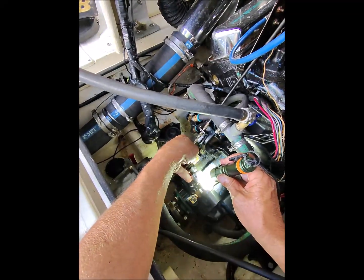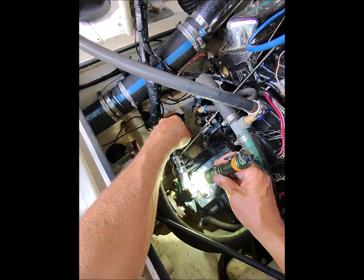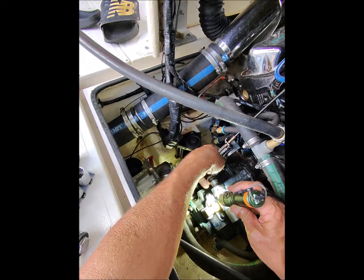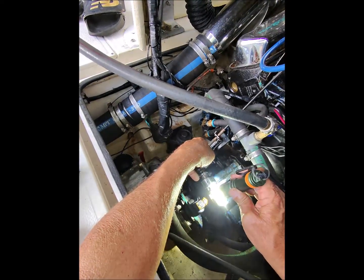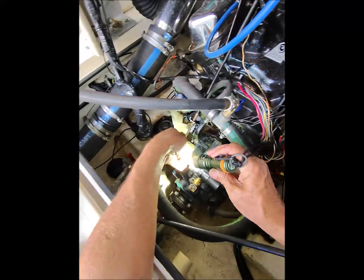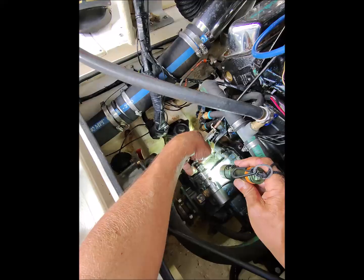These holes here are the feed for the whole system coming out of the pump. So the pump comes through this main channel here where this Allen head is, and you can see how that lines up. So the pump is feeding fluid into these 4 holes, right? Overpressure, the spring opens and dumps fluid into the cooler. Okay, so this thing is sitting in its neutral position. So the tab is down, lever is where it should be, and the flats on this valve are not pointing to any of the galleys for the oil.